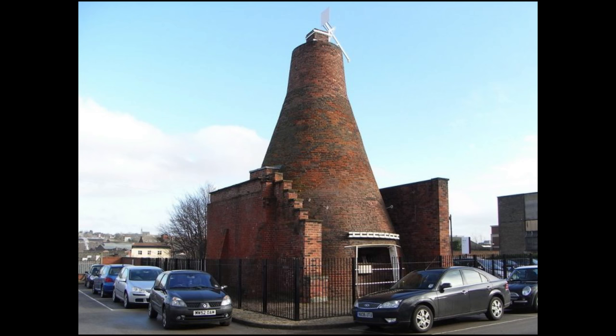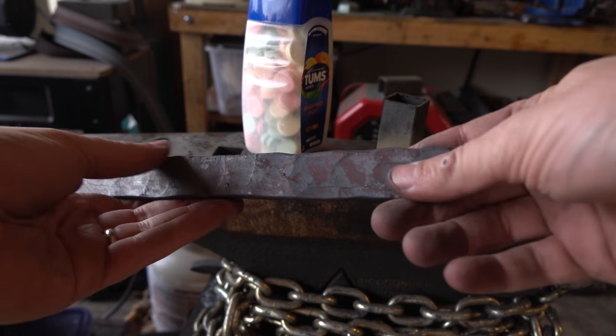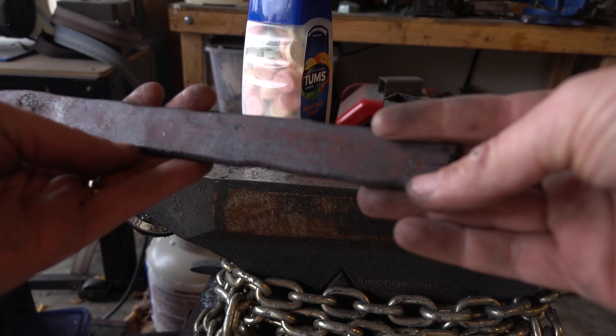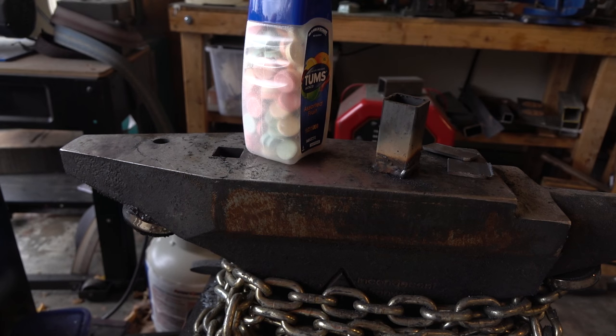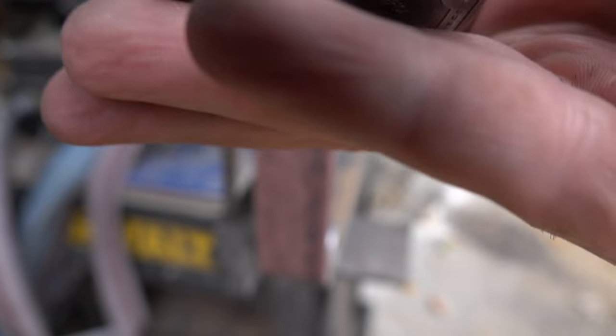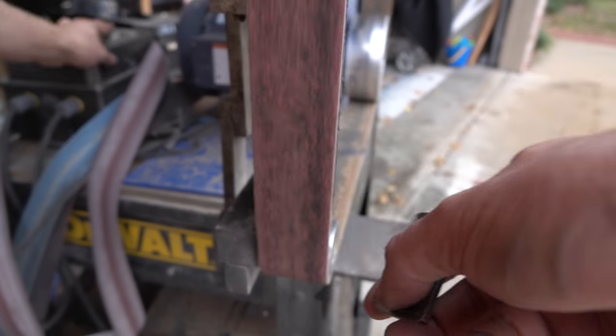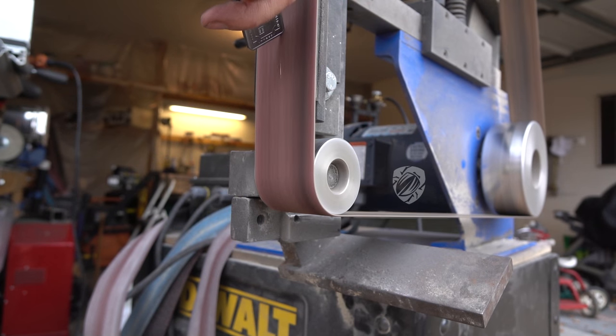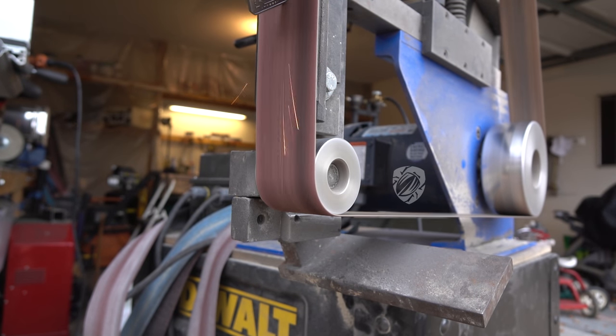We're gonna run into some problems because this iron is not so good — you can see all those cracks running longitudinally along the sides, edges, and ends. I read about a phenomenon called cold short iron: some impurities like phosphorus and sulfur can make iron brittle or unusable. At any rate, this iron we found on eBay is pure iron, so that takes the mystery out of the equation — we're just dealing with iron, no alloys or funkiness to interfere with our experiment.